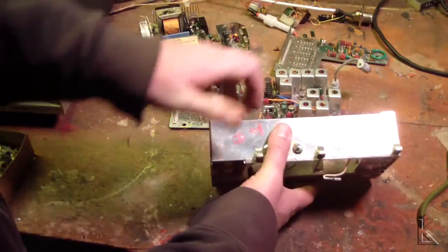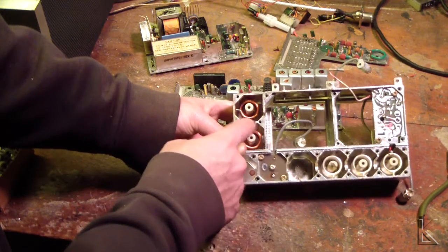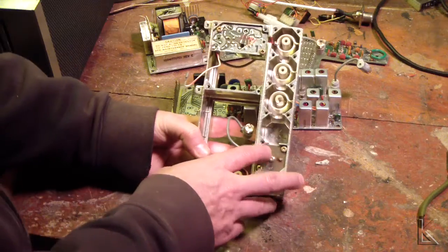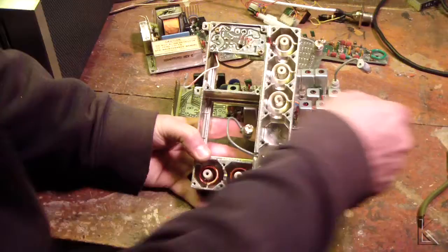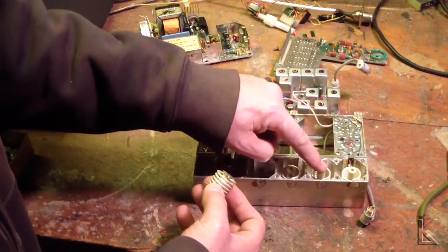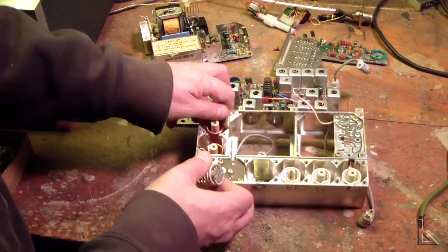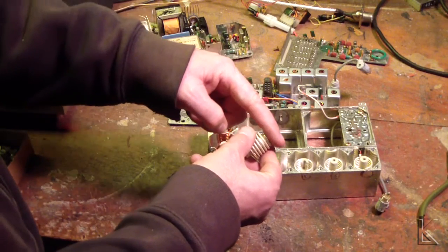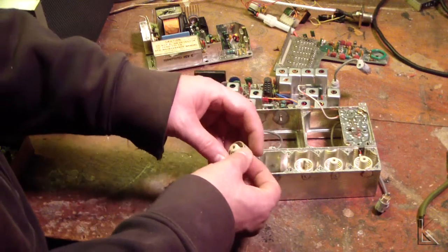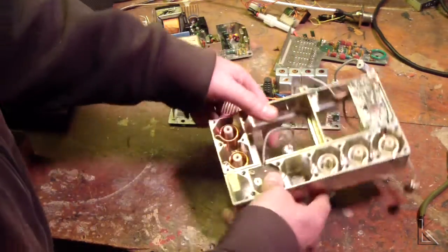The way this is built — this is a cast piece of metal. Look at that. Inside of each of these you've got an inductor that runs up in and a little metal plate. And there's the capacitor plate that you adjust with the screw on the front. You're gapping that against this plate here. This was mounted by a screw at the back — you can see that it floats. You adjusted that plate to vary that distance between the capacitor. It had this inductor wound and going to ground right here. I was able to pull this one out because it had been re-soldered and not done correctly. The joint was cold — the pin was just floating loose in the hole. That's why it was flaky.